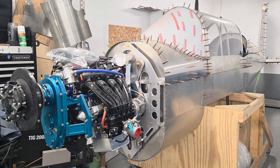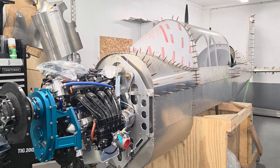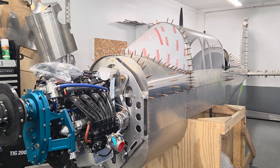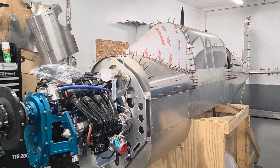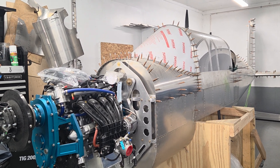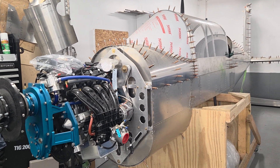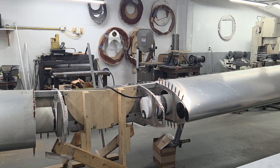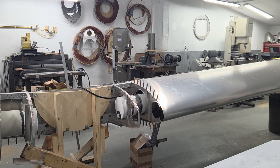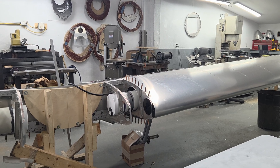There are a couple of questions that will come up. Expected fuel capacity is 32 gallons. Cruise speed — the math says 140 mph. It's a pretty narrow, streamlined fuselage — the wing has pretty big chord and it's fairly thick. We get 120 miles an hour in the H5 with 85 horsepower, so based on the wing area and everything, math says about 140.